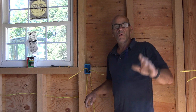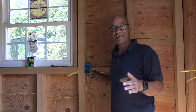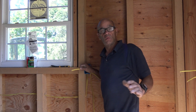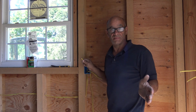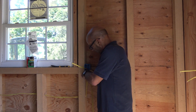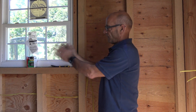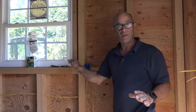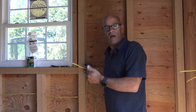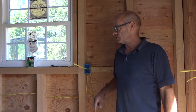One last tip: on the back of an electrical box, you have a left side and a right side, with holes on top and bottom where the wire comes in. Besides labeling the wire — because the label only works until you strip it out — what I like to do is run the wire through a specific side of the hole. This wire here is coming out on the left side of the box. Once the sheetrock is on, I can look in there and know that wire is coming from that side — the next outlet over. Wire on the right obviously comes from that side. It really helps to know which way the wire is going.